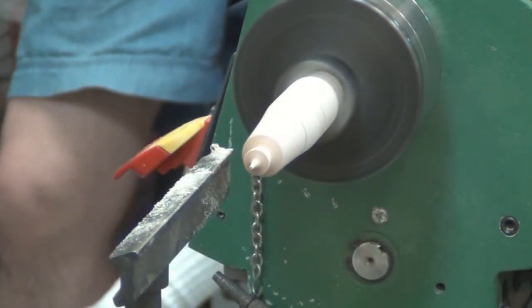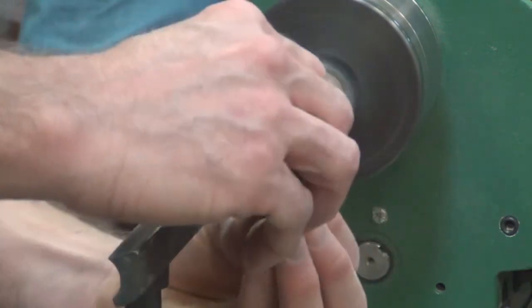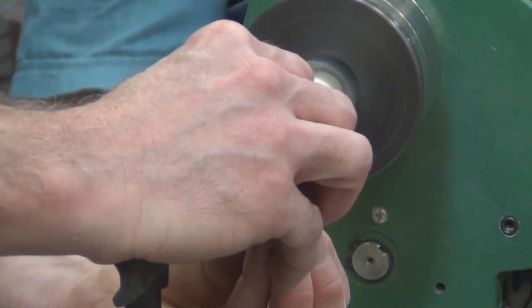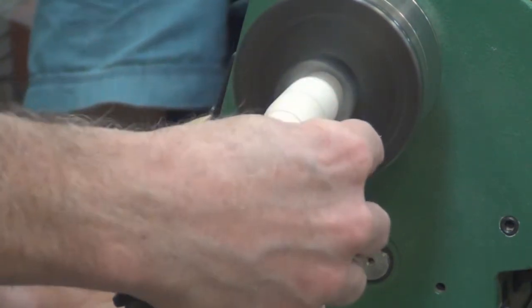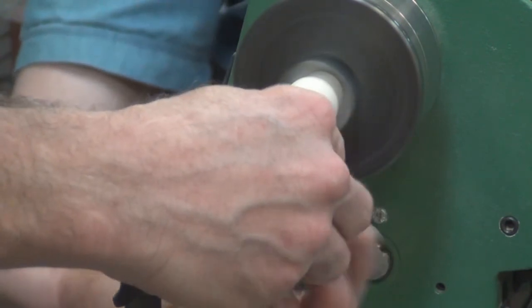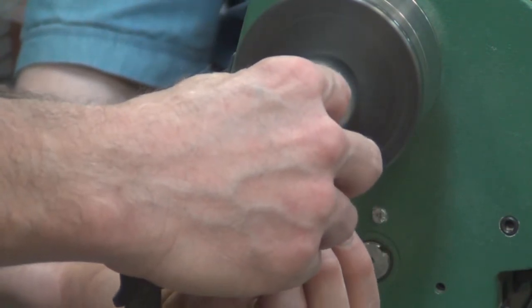The other thing, as well as supporting the cuts, you never want to go back on work that you've already done, and that even applies to the sanding. So I'm going to just sand this top little part. I like using this Abranet, and I can just kind of hold it in a curve.